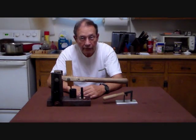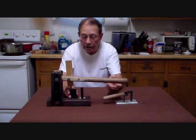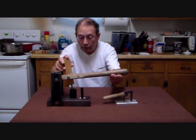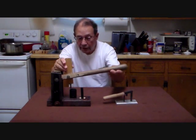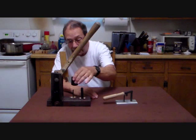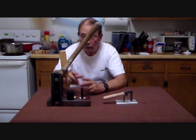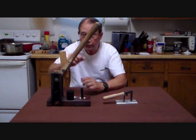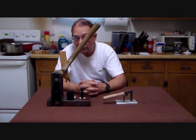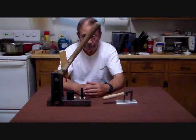We have now completed our successful modification of the Mark I loading stand. So now we can load two different sizes of revolver cylinders. As you see, the plunger goes smoothly in and out of the chambers, and that's exactly as needed. Now there is still room, but if you had a different size of cylinder, you could mount it right there, although you would need to put a dog leg on your plunger here, and it would work best if the cylinder was for a smaller diameter, say 31 or something like that.